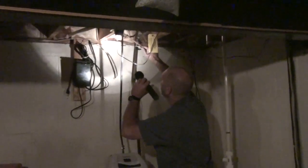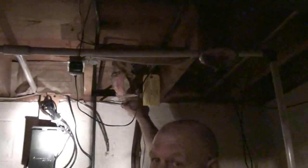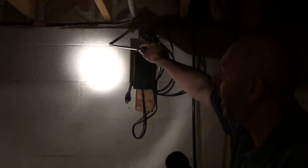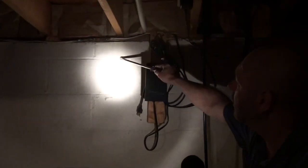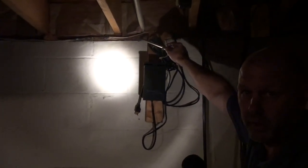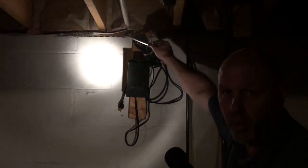That's the sill plate that you're hitting there. This is the sill plate that sits on top of the cap block. These blocks are all hollow blocks that the foundation is built out of. And then when we get to the top block, it's a cap or a solid block. That'll act as a moisture barrier but also a termite shield. If we have termites into the house, they're usually going to be into these lower pieces of wood, and so if there's damage we'll poke right through it.